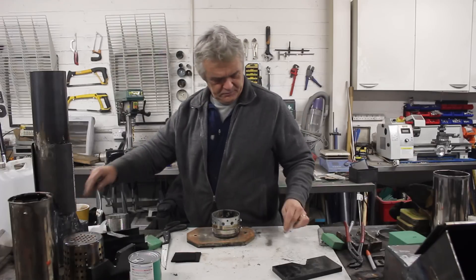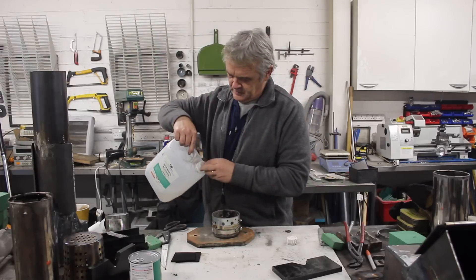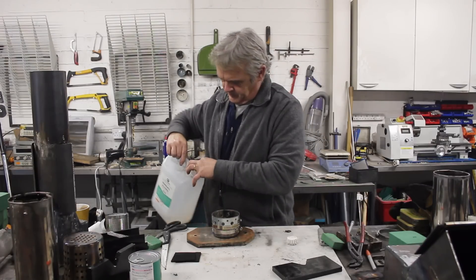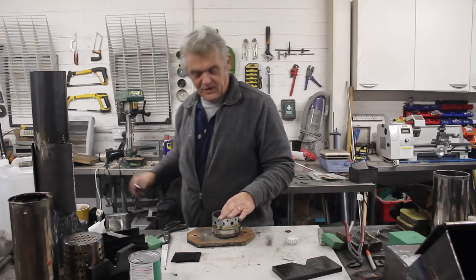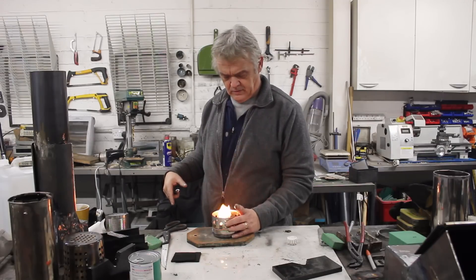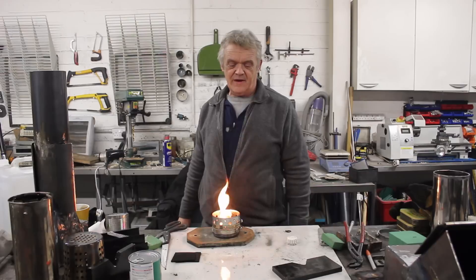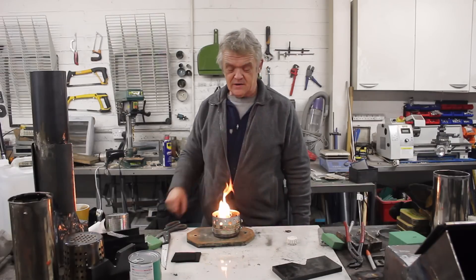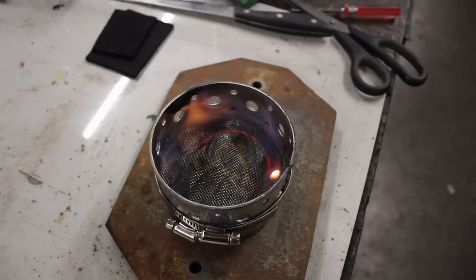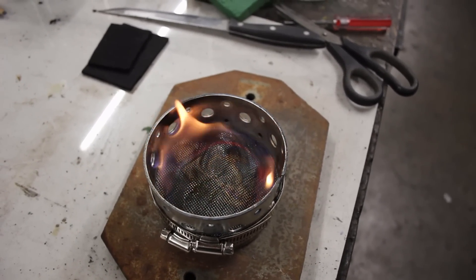To start this, you put a little pre-start on there — just a bit of paper soaked in alcohol — and then light it. Once the heat passes through the wire it will start to evaporate the alcohol. You'll actually see the wire go red, and then it'll just continue to burn as long as there's fuel in the Oasis. The fuel pad goes first, the wire goes red, and the heat of the wire vaporizes the fuel underneath.